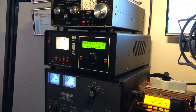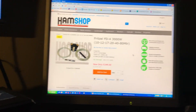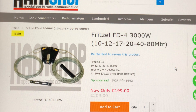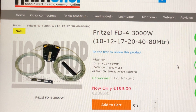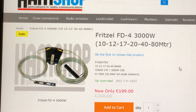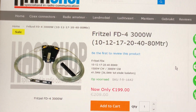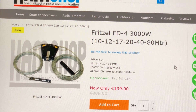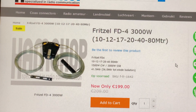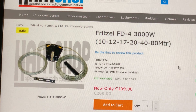What I want to show you today actually has nothing to do with the radios, amplifiers, tuners, or computer — what I want you to see is this antenna right here. That's called a Fritzl FD4. I have one out there; I've had it now for well over 25 years. The gentleman named Kurt Fritzl, who is a silent key now, made those, and they were sold at Ham Radio Outlet around the early 90s — I'm thinking '92, '93. That's a 6-to-1 balun in the middle with aircraft control cable.